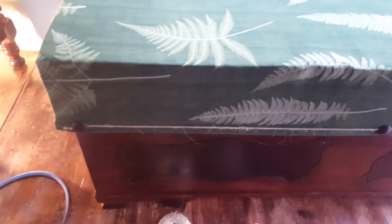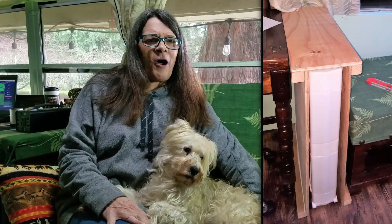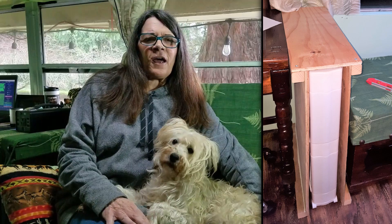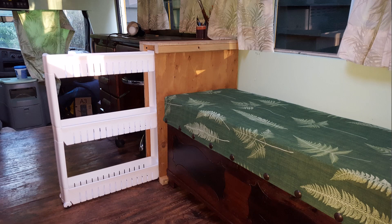To do a straight line on the front, I attached a string so I could nail across straight — and believe it or not, it's still hard. For the arms I built three-sided boxes, with one-by-ones on the tops and bottoms of the sides so I'd have something substantial to screw the tops on and attach them to the floor. I sewed the edges of the curtain flaps, glued one-inch foam to the top of the arms, and wrapped them like a present, securing with upholstery tacks and staples.